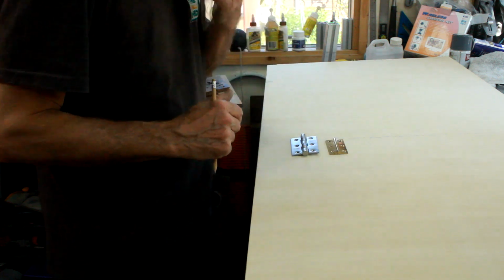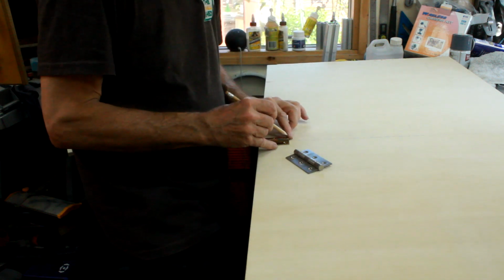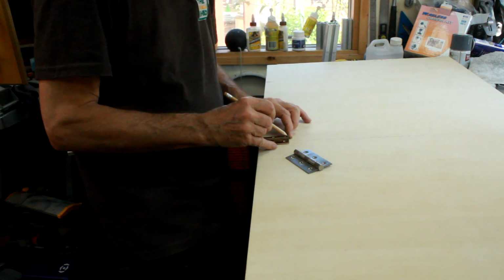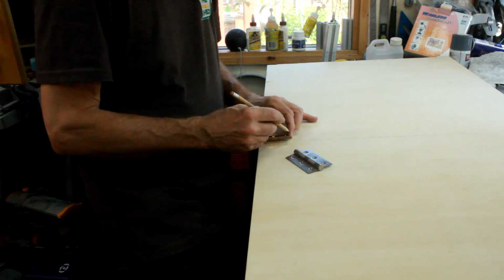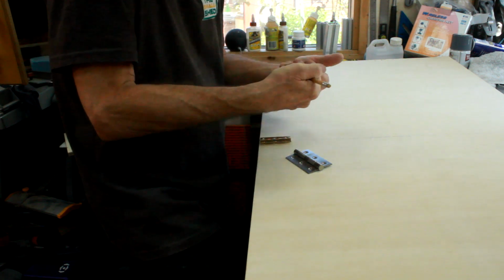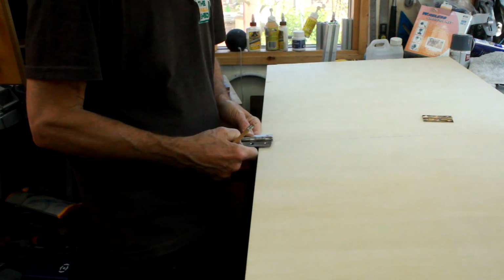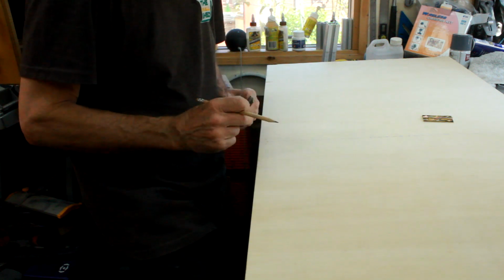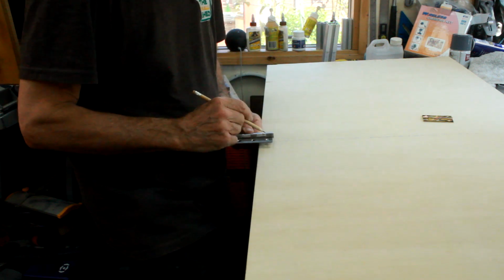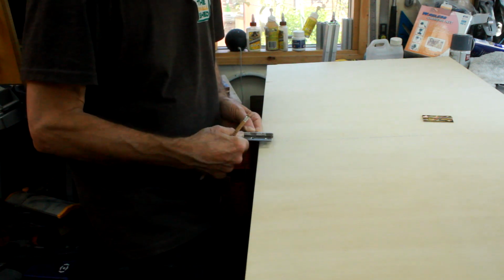That in itself isn't a problem, because the hinge point has got to be at least as high, if not higher, than the track. Otherwise, when you hinge the board up, the track will crumple into itself and it will all get distorted. So I'm going to have to put a packer underneath, so it can then just take that curve out by putting the packer on one side or either side of that, and it'll work okay.